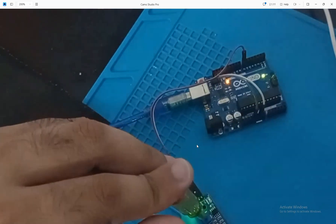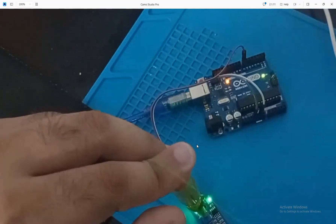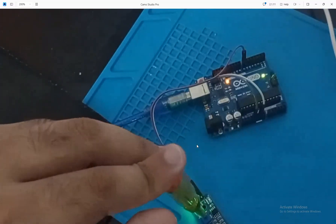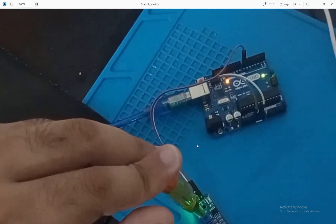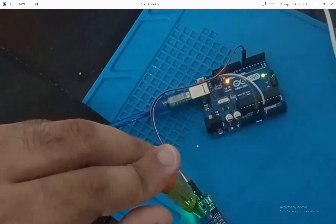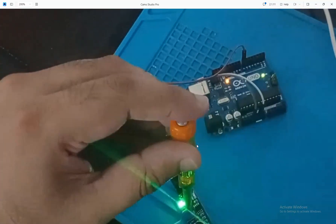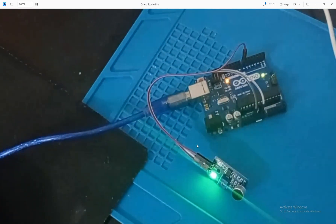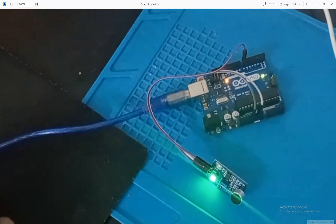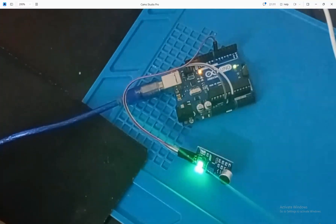What I want is that if some sound is detected it will say 'detected', that's all. I set the sensitivity as per my room. Now when I am silent the LED remains off, and when I speak the light comes on — it is listening. This potentiometer will be adjusted in your application depending on the project you are making. When there's a little bit of sound it will say 'sound detected', and now let's get to the Arduino IDE to start programming.